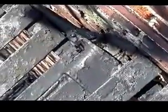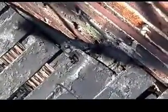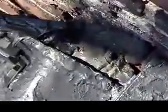We're going to descend down this flight of stairs. Your stringer consists of a 1/4 inch flat by 6 inch, and we have some issues. You can see right here, tar has been filled in, but we definitely have a problem as far as the stringer spreading, and it's probably due to rust jacking or it's overstressed. You can see it right there.